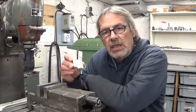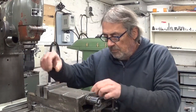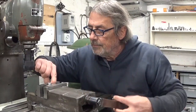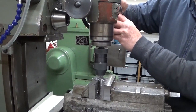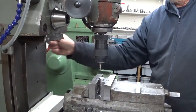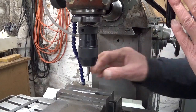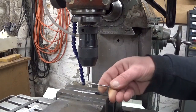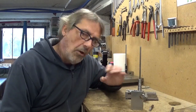Not even half an hour of work and ready to go. I will protect my little piston with a piece of brass sheet here. To drill the cross hole I use this cute little three millimeter end mill, because I was afraid that the normal drill bit would grab in the other hole in the length. And this worked like a charm.